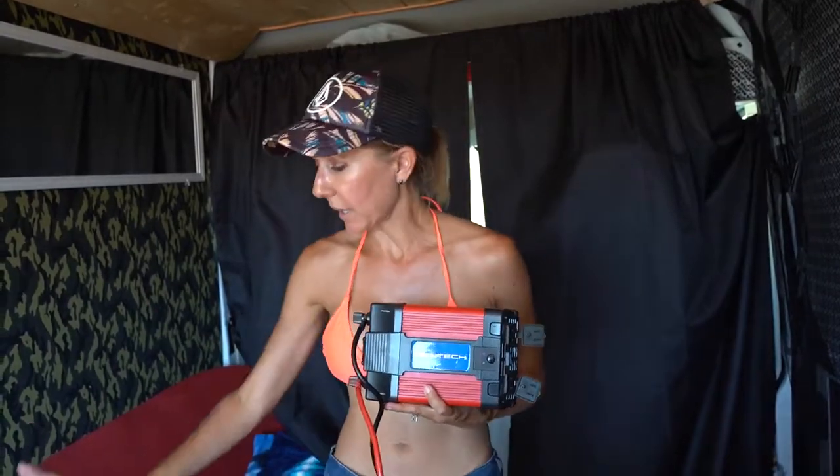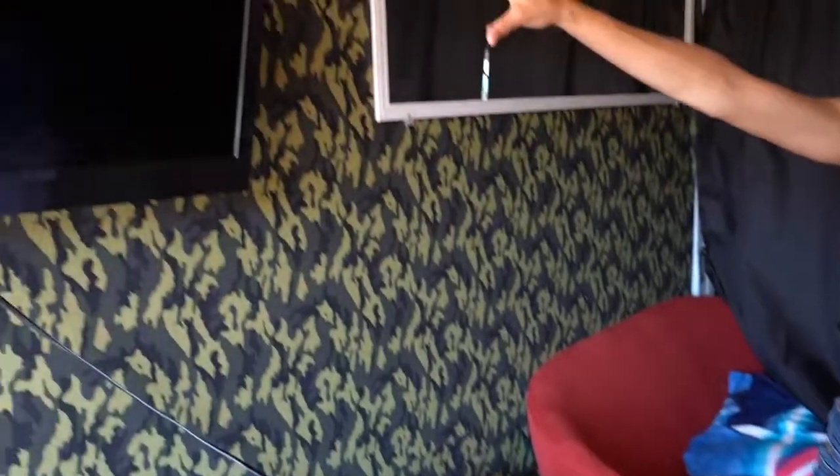The battery I'm using, connected to the solar panels, is a 420-watt battery — it is a 35 amp-hour battery. You multiply that times 12 volts, which gives you 420 watts that you can use in an hour. However, for a battery you only want to drain it approximately 50 percent, so that really only gives you 210 available watts per hour. What I am using is less than 210 watts: my inverter draws approximately 10 watts, my DVD player approximately 10 watts, and my television approximately 80 watts — so running all three together is approximately 100 watts, which means with this battery fully charged I have approximately two hours of available time.